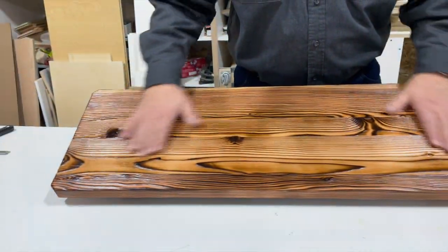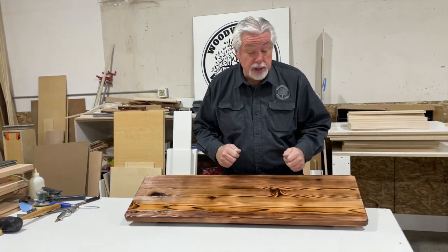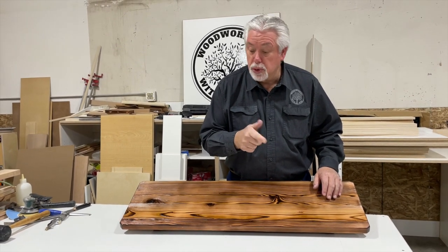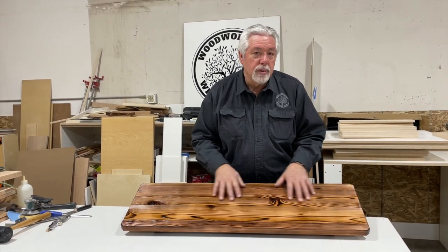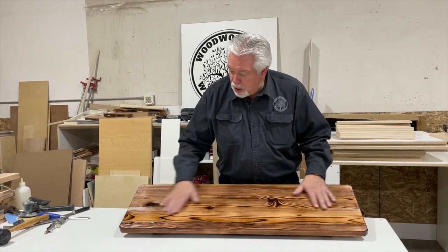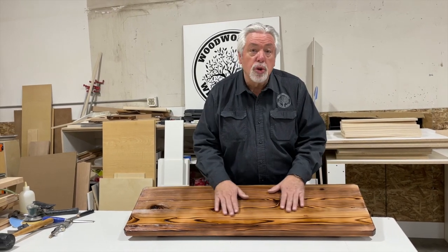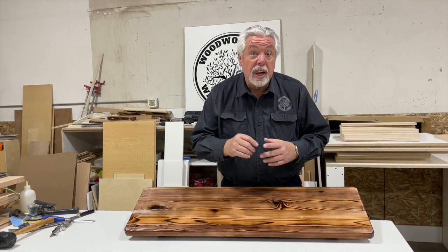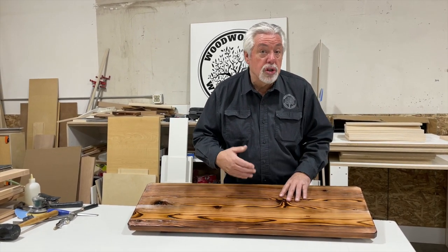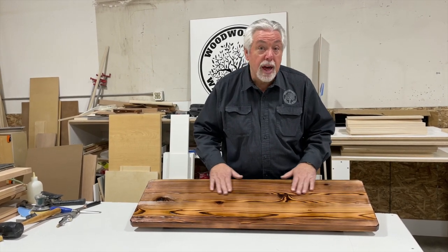like it. So we came back, we took our Makita wheel sander, and by the way, it works as a great stripper tool. We wheel sanded off that original finish. That also took a layer of the char from our original burn of our Shou Sugi Ban. And we ended up with a much lighter finish.